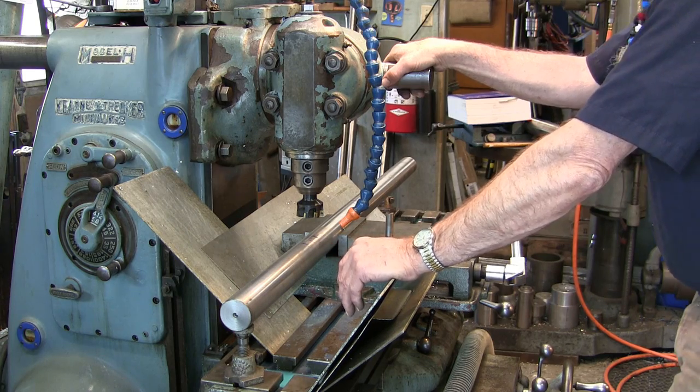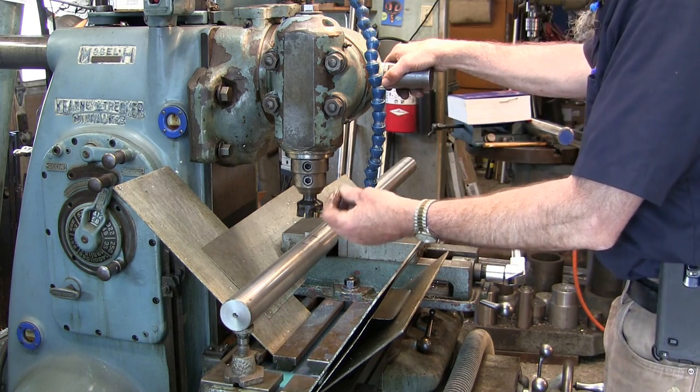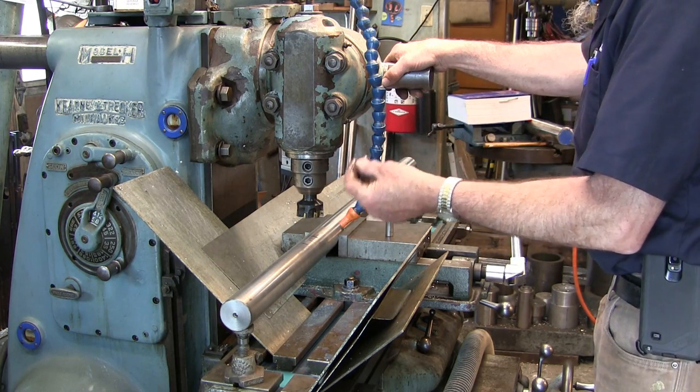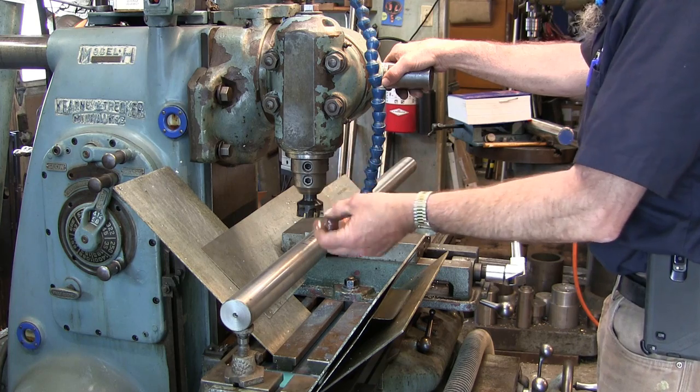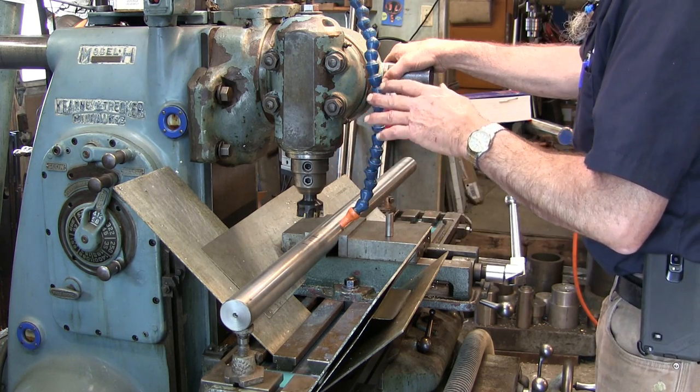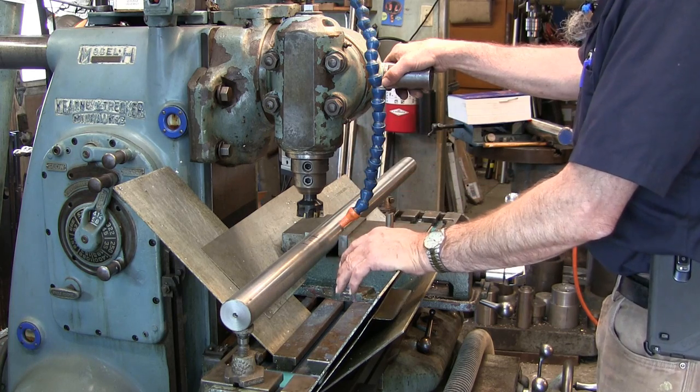So everybody has their own preference. I like how slippery this is. I like how it cleans the machine as it's working. And I like how when I get a cut or something like that, I'm not getting infected, because I believe the coolant stays fresh longer.